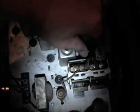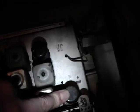And again, whoever this was didn't realize that these metal guys were tubes, I guess, or just didn't care about metal tubes, so left them all in there. They're pretty good. So this is the one that I thought was a little odd. It's a 6SB7. I don't recall ever encountering one of those before. So I figure it's just one of those tubes that was used in early FM radios, and after that they didn't find much use in anything.